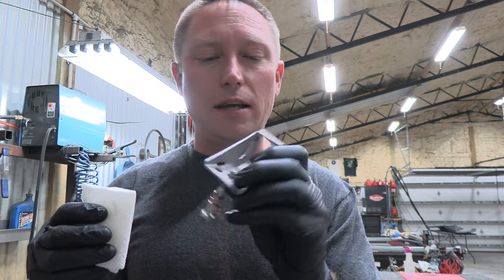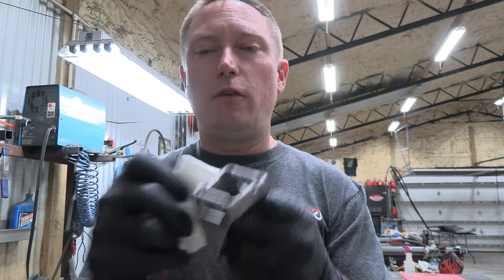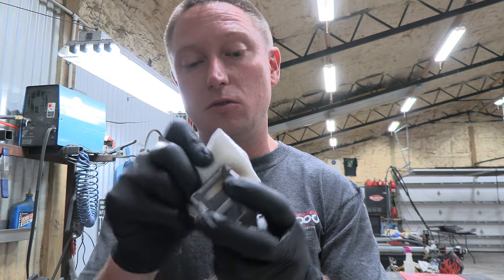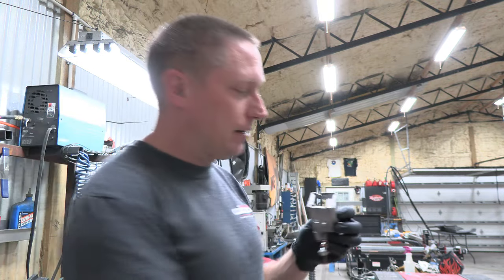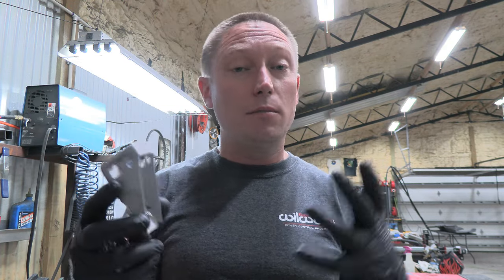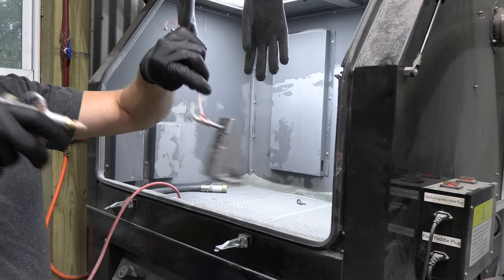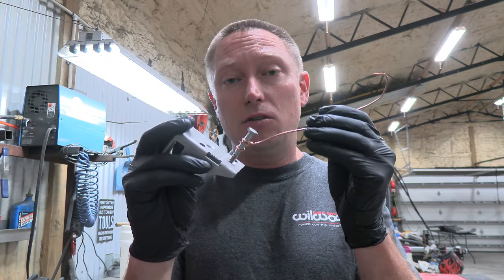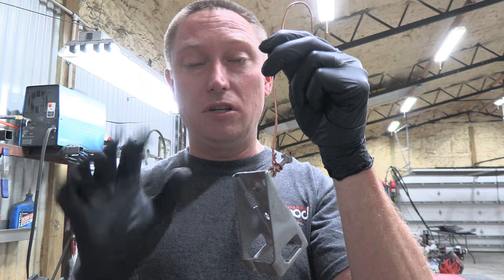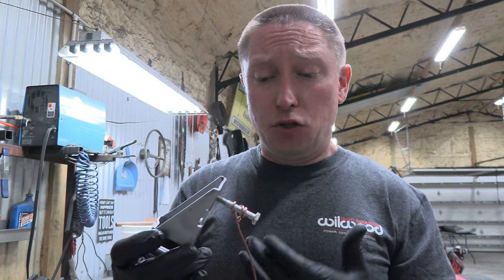The first thing I've got to do is clean this part down to bare metal. Before I sandblast it, I'm going to wipe off any oil residue using lacquer thinner — you can also use acetone, there are all sorts of good cleaners. Then I'll put the part inside the media blaster to get it down to absolute bare metal. When I pull it out of the media blaster, I'm not going to touch the part anymore — only the bolt — and I'm using gloves to keep the oil from my fingers off the part. Any oil whatsoever on this thing will ultimately destroy your finish.